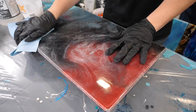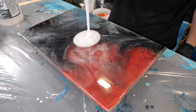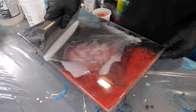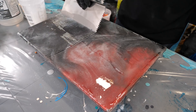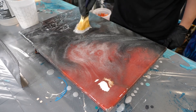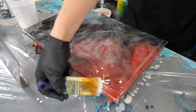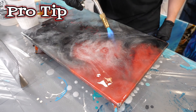Just lightly sand with 220 so we can get a good mechanical bond. Trowel brush — make note to pour your epoxy in the center of the piece; this will help you not waste as much. Make sure to pull any loose bristles on your brush and prime it before chopping. Chop randomly — this is gonna help hide those trowel lines. Also don't forget those edges.